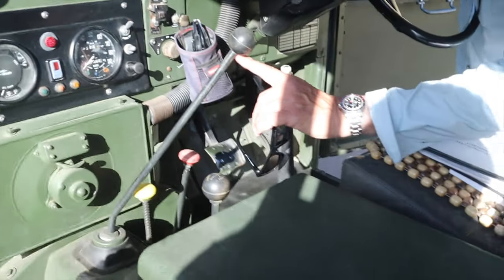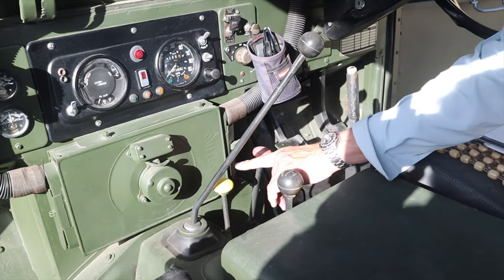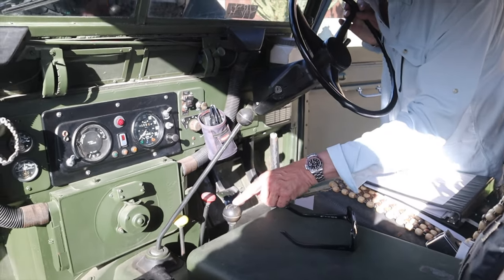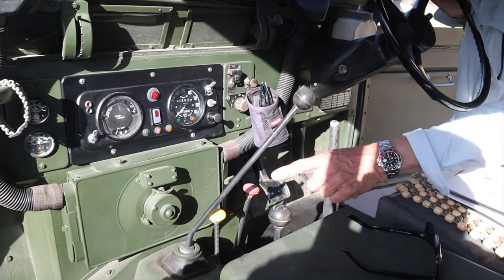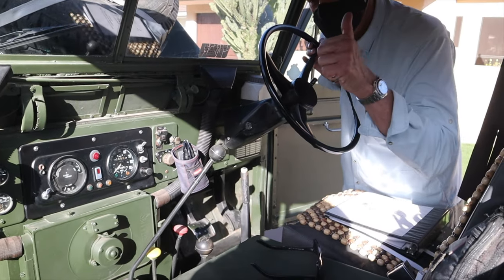We were talking earlier about the Fairey overdrive. It will literally go anywhere. Even though it's 70 horsepower, you've got something like 32 forward gears with all the combinations — two-wheel drive high with four forward gears, four-wheel drive low with four forward gears — and then every single one of those gears has a 1.66 splitter. So you can go 1, 1.6, 2, 2.6, 3, 3.6, 4, 4.6 overdrive, and you can do that in two-wheel low, two-wheel high, four-wheel low, or four-wheel high.